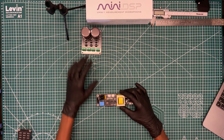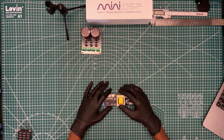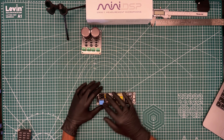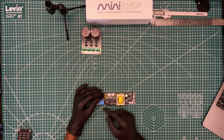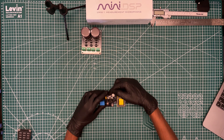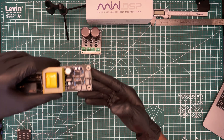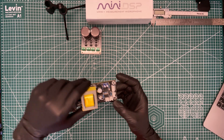We take the AC from the filter board and plug it to the input, and the output goes to a transformer — a toroidal or EI transformer, anything. So this controls the outflow of power to the transformer — this is what does the switching. That's why there's a relay and an NTC. NTCs are thermal resistors, and anything with NTC you should know is hi-fi. There are multiple other sockets here as well — there's something called a trigger, a PRO (program) pin, a switch, and an LED.